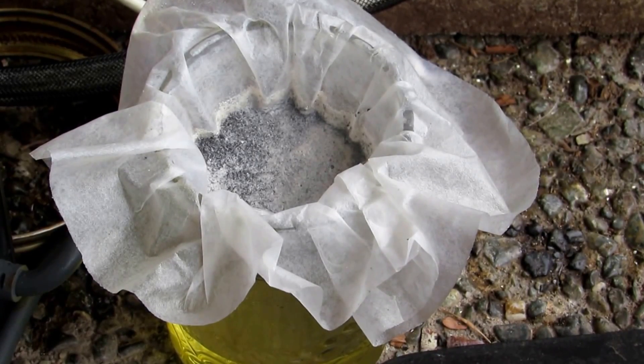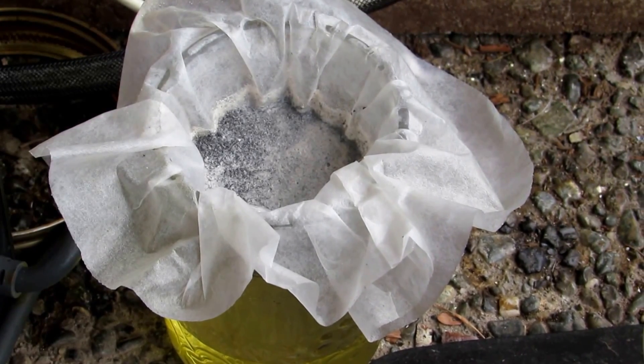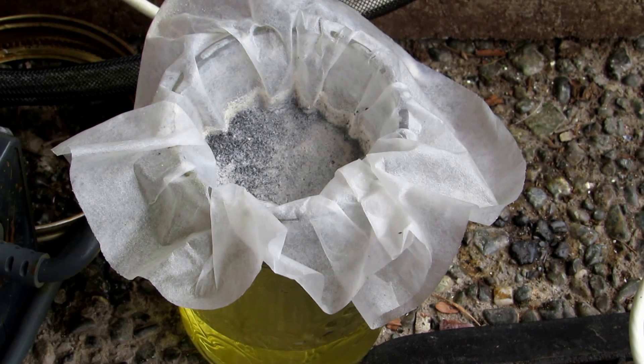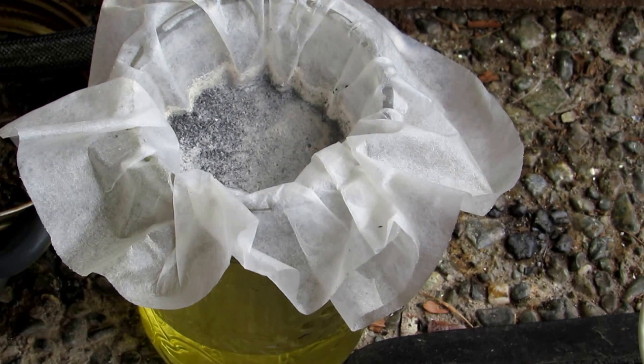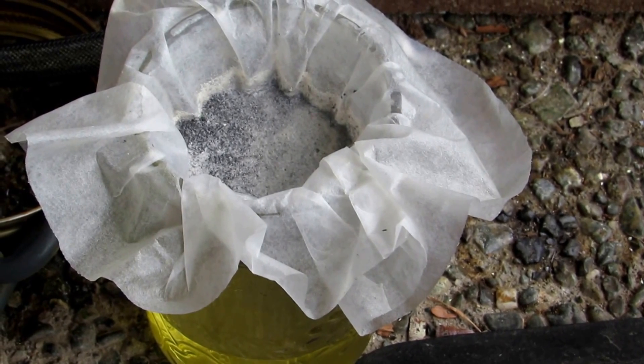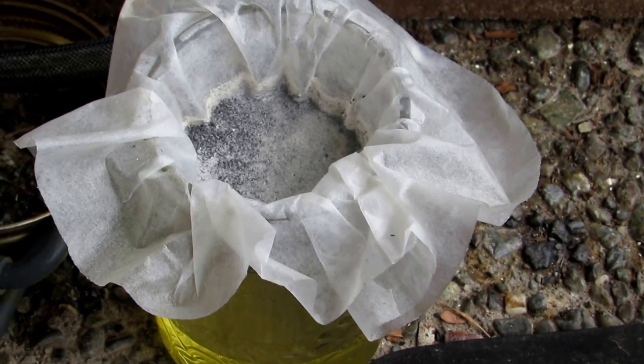You can see we finished reacting the aluminum. I added a bit of extra hydrochloric acid at the end to dissolve all remaining aluminum, then let it stand for a bit. In there you can see there's a bit of bubbly foamy stuff still on the top, from the very beginning with the calcium carbonate reaction forming carbon dioxide and all that foam. But for the most part it's all bismuth metal in there, and that foam will be gone as soon as we heat it up. It has been totally filtered off. I'm going to remove this, stick it on a brick, grab our blowtorch, and melt it down.